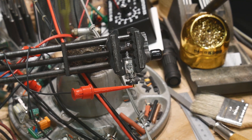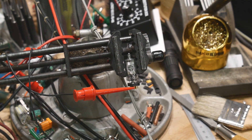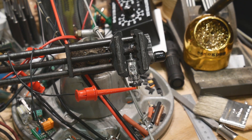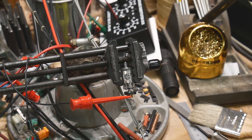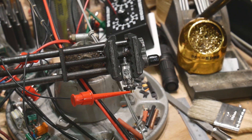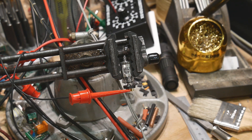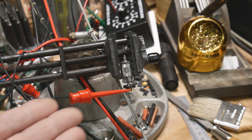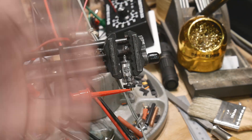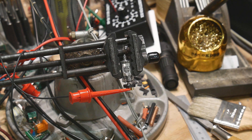They have a quiescent operating voltage of 145 volts. So that's why I have that resistor in there — they fire at a high voltage but then start clamping down at a lower voltage, around 145 volts. I have the anode hooked up, and then with the ground lead I'm going to poke around on those different leads and light up the different segments of the display. They're basically just a neon light bulb with different pieces of sculptured metal that glow — different shapes. Let me change camera lenses and get up close to this little guy before we light him up.